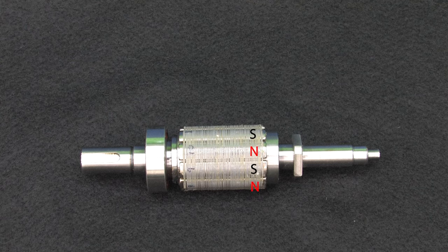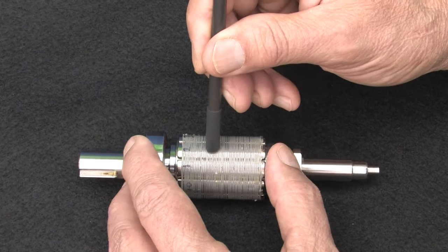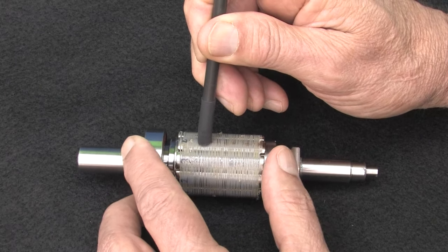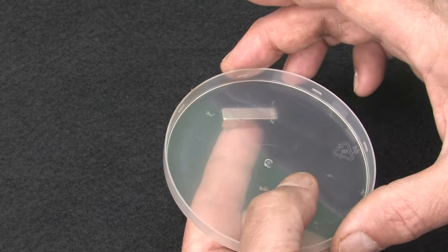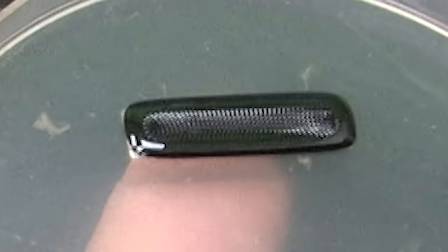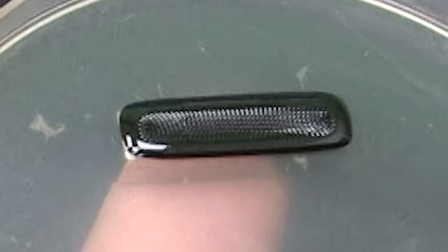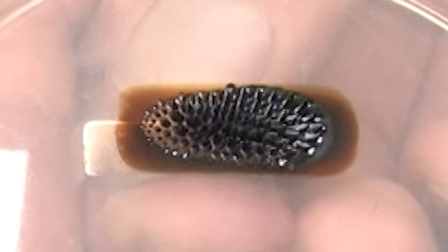It is important to understand that the polarities flip with each magnet. I have a small neodymium magnet on the end of this aluminum rod. It is attracted to this magnet and then it skips over one and goes directly to the next. Why is that? Well, if this is our rectangular magnet on the rotor, the magnetic field radiates out like this and wraps around to the back side of the magnet. We can see that if I put a rectangular magnet under this dish and drop some ferrofluid on it. All the little spikes are showing us the directionality of the magnetic flux coming off the magnet, and the number of spikes shows the intensity. If I pull the magnet away,